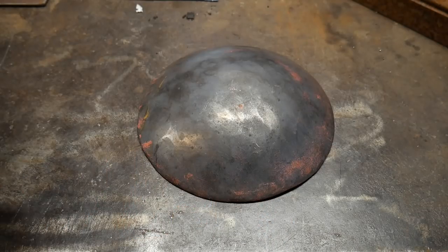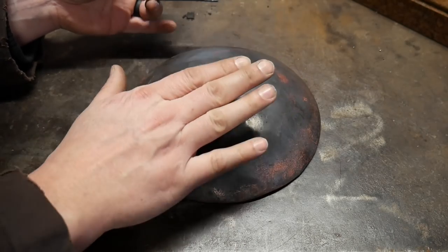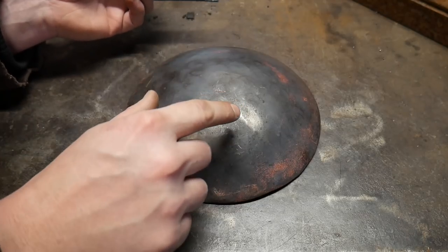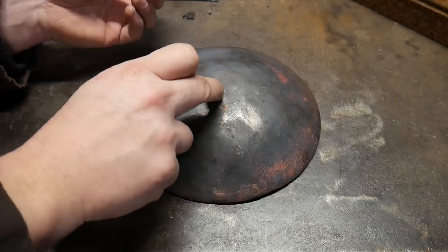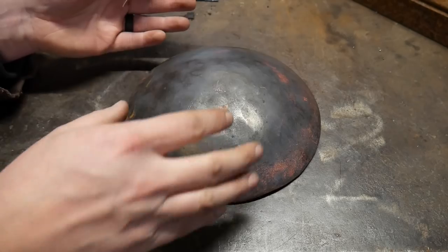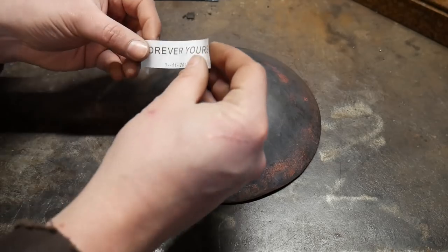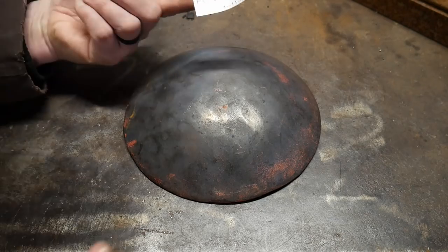Now that we have a couple of tags created, we're going to get this put on the bowl. I do this while there's still forge scale — it doesn't have to be impeccably clean. The only time you need to clean first is if there's damage from a rough anvil that you want to grind out before laying down your label, so you don't sand away your lettering later. There's that 3M adhesive tape again — Jessica put links to that in the description below.